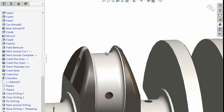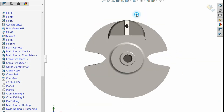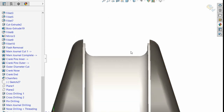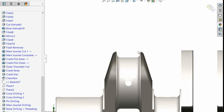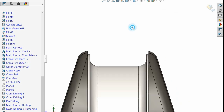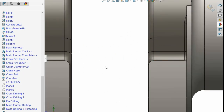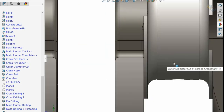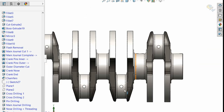You'll notice I've added some little things in here. You'll notice, or hopefully you've noticed, because I did actually go out of my way to do it, that these two don't look exactly the same. You will see that with crankshafts, right? I've got to turn perspective off, that might help. Turn that off. I'll just put the lines on as well, so it's even easier. You might notice that this is a bit broader than this one, right? You might notice on your crankshafts that this is a square edge, where this one has a slight radius to it. I actually went out of my way to type in some little dodgy numbers into this, so that they're not all equal, right?